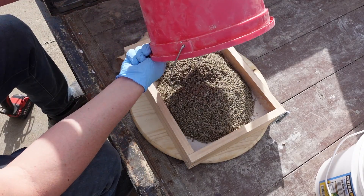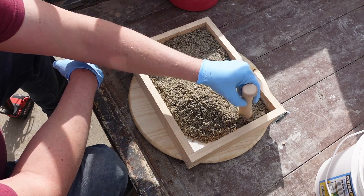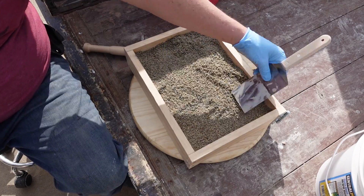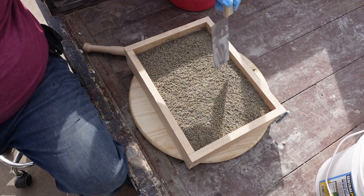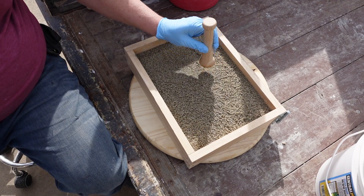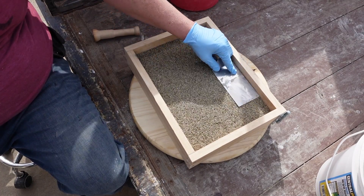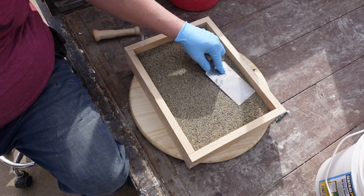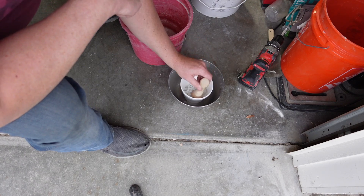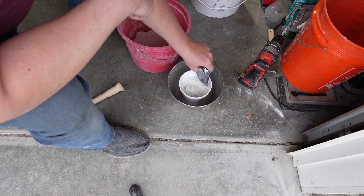I'm using the sandblasting media as a face sand, and then I have a heavier grit sand as the top sand, so it ends up kind of looking like a cake — actually pretty neat. I think we'll do another video just using the sand as a casting media all by itself. We'll be doing the skull doorstop out of this sand because it's extremely hard and works really well. I'm just smoothing everything out and making a casting cup, experimenting with different methods, getting it compacted down and then opening it up for the cup.